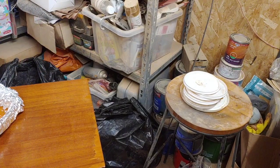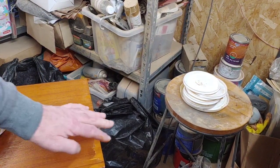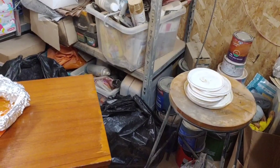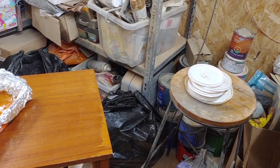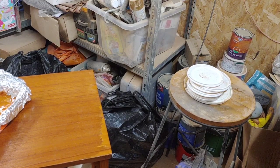So there we go, you can see that the colour's coming along, and you've got a slight stripiness in it, because that's what we want to keep it to, a stripiness, so it looks like a teak, because you've got a lot of stripiness in teak. So I'm going to mix up another colour now, and then we're going to start doing a bit of grain over the top.